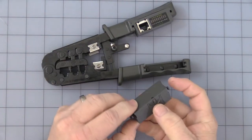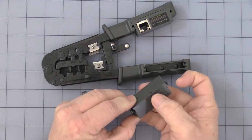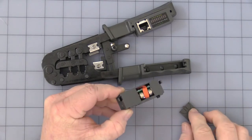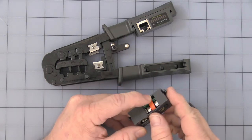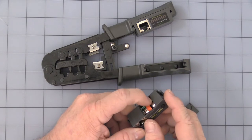This is where the batteries go. There's a little center raised ridged area — you can simply press that and slide it back to install or replace the batteries. They use LR44 batteries, three of them, and polarity is marked on the inside PC board, minus and plus.